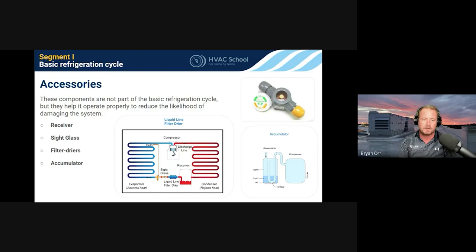If that screen or orifice gets blocked, the compressor will eventually starve for oil and fail. A lot of technicians don't think about that. Whenever working on a system with a compressor failure, if you can replace the accumulator easily and inexpensively, generally just do that. Our standard protocol is to cut out the accumulator every time we find a failed compressor — it's better to just replace it.